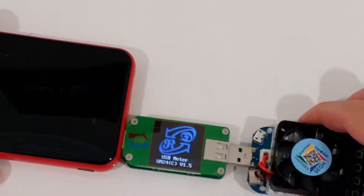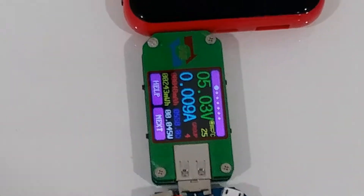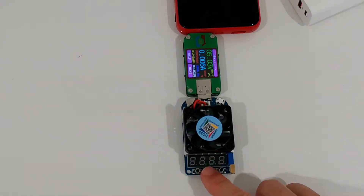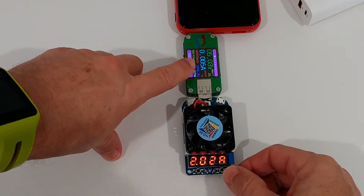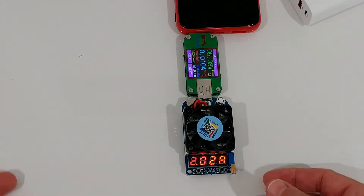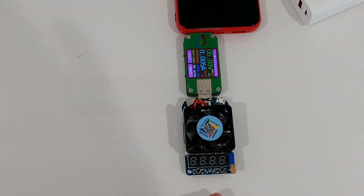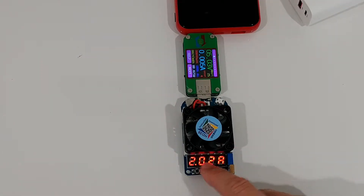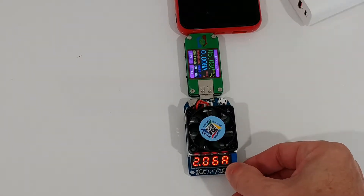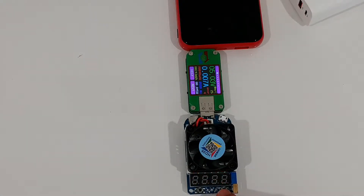When we plug it in — let's say here on a power bank — you can see that it always starts with the amps display. We can see on the power meter that it doesn't start the load testing; it just shows the display with the amps. Based on the ohms which we set with the potentiometer, it will produce certain amps on 5 volts. Let's put it to 2.1 amps, which is supposed to be the highest for this power bank, and we start it.